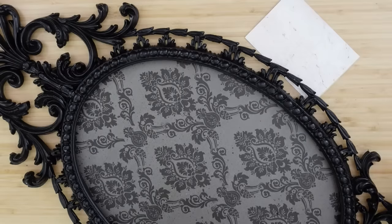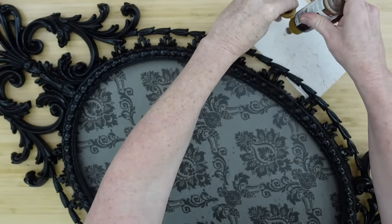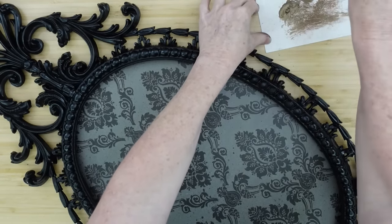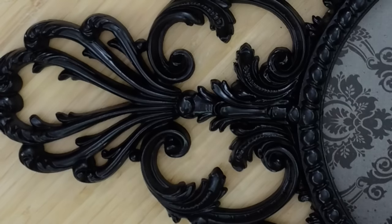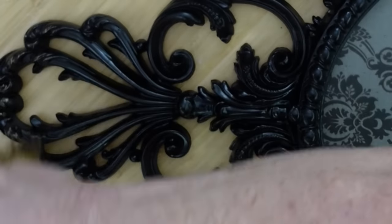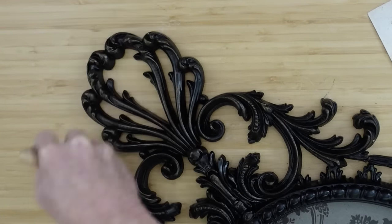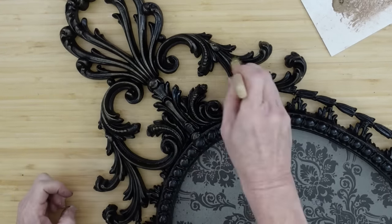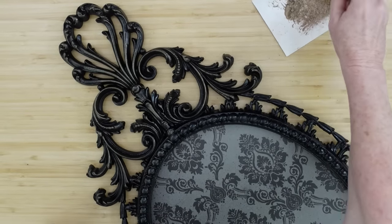When I get it on there, I'm just going to dry it with my little tool — I don't want anything smearing. So here's that Rich Espresso. I have bronze colored paints but none that have the depth I want in a bronze. I think this over the black is going to be the perfect solution. If you use that chippy brush and just start going side to side with sweeps all the way across — I'm not trying to get down in the cracks. The black is going to be down in all the spaces, and the metallic color is going to sit on the high points, so it makes it look like a tarnished finish.